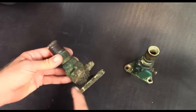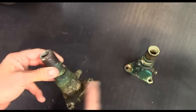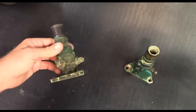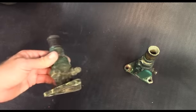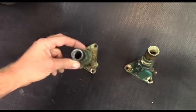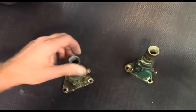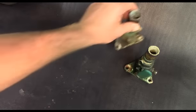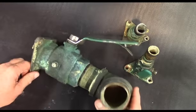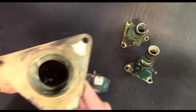This one you can see — the handle has just disintegrated. Whatever material was in the handle is now floating around in your bilge, probably waiting to get sucked up in your bilge pump. You might be looking at it like, 'Oh, that's no big deal, my bilge pump can keep up with that, or all three of my pumps could out-pump that.' But what happens when you can't shut this one off? That's a lot of water coming into the boat.